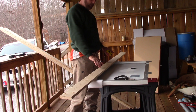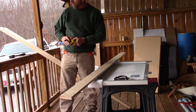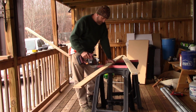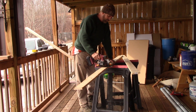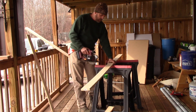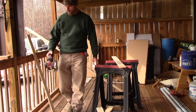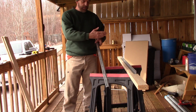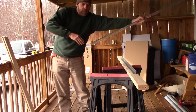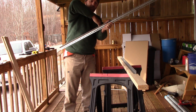I'm going to make the boards just a little bit wider than the solar panel so I have enough bite and enough clearance from the windows. These brackets give me an adjustable angle for the sun — because they're slotted, when the panel sits on top I can move it up and down for winter sun or summer sun. It works out really well; I've done this on three or four mounts already.